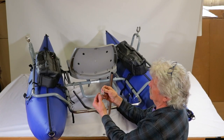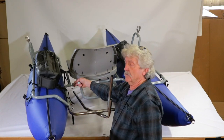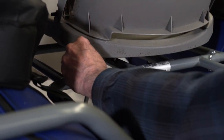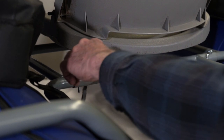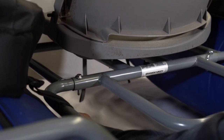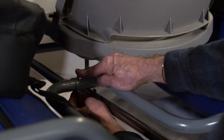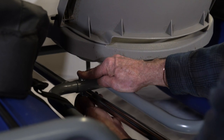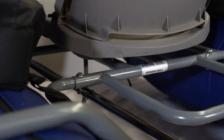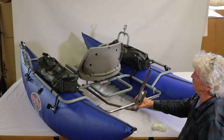Then you have a clamp and a bolt which go up front to replace the pin on the left — pull that out. This is a retainer for the rope tube, and it goes in place of the pin on the seat to hold the rope tube. Put the clamp on to retain the rope tube underneath, run the bolt through, and tighten it up with a 7/16 wrench after securing the universal anchor system to the boat frame.